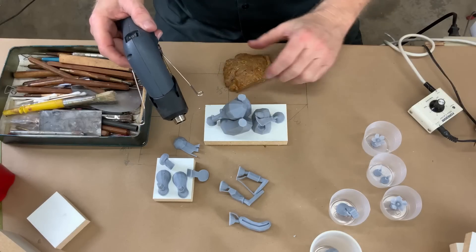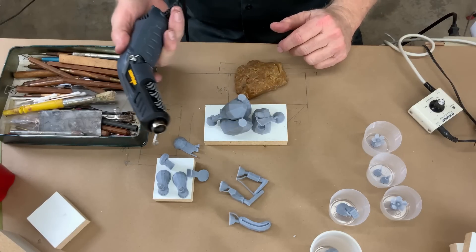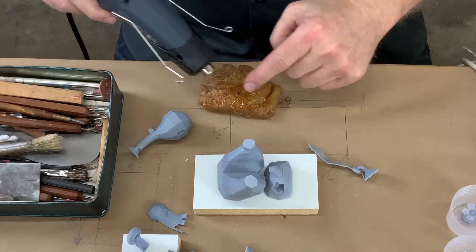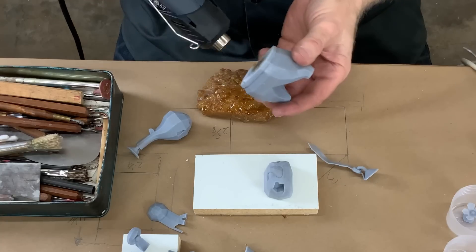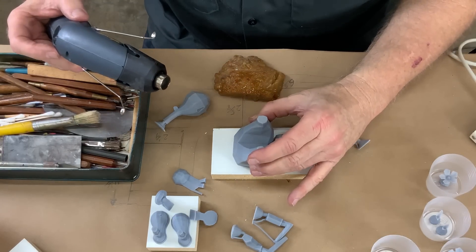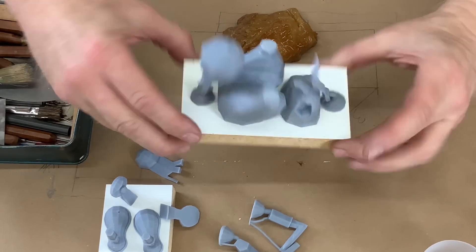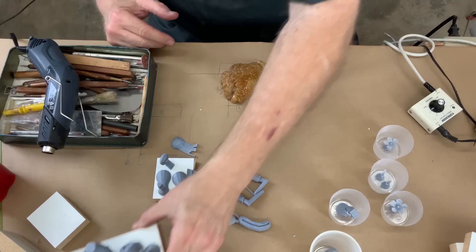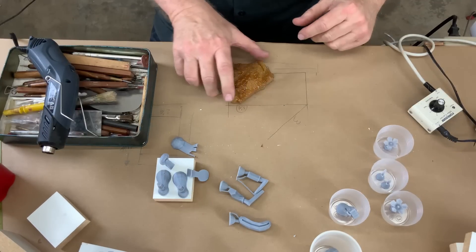If I have a lot of pieces to do like this, I like to break out a micro heat gun and just get the wax hot. Then when you've got a pool of melted wax going, dab it onto the surface of your part. You don't need to totally coat it, you just need to hold it in place. They hold perfectly. Let me wax up all of these and I'll come back when we're ready to pour rubber.